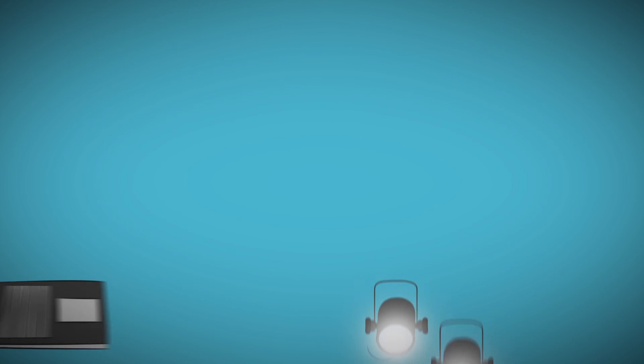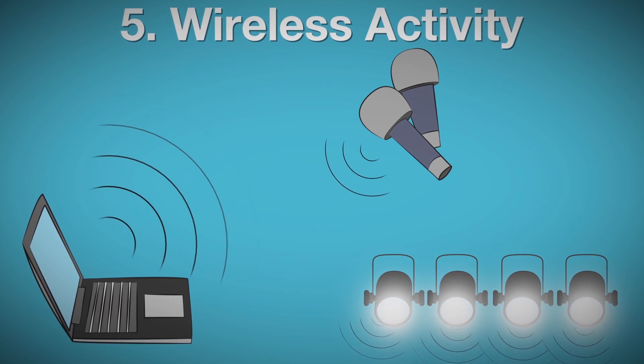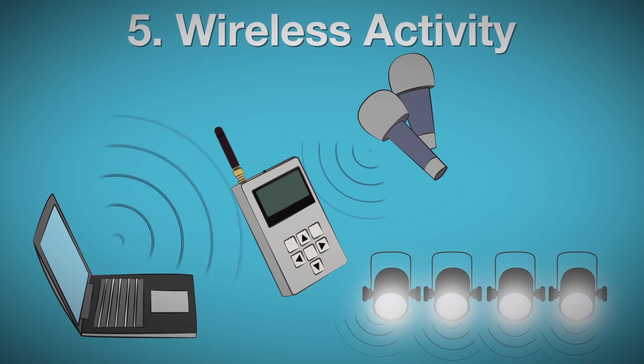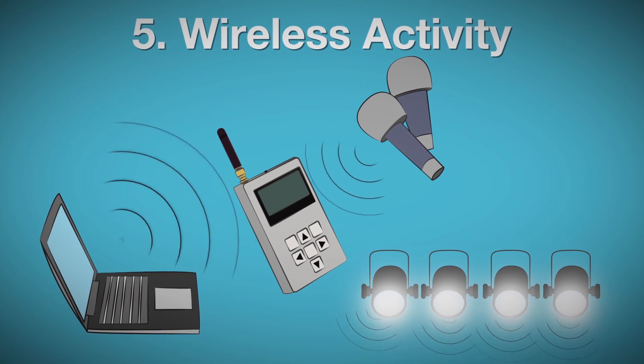And finally, be aware of the potential for other wireless devices and other electromagnetic field emitters in the area. If possible, use a handheld spectrum analyzer to observe where live wireless traffic exists in your RF space, because new activity might be there.